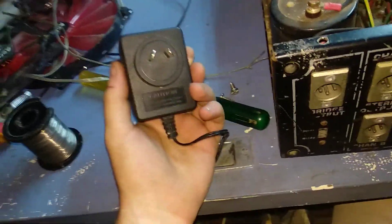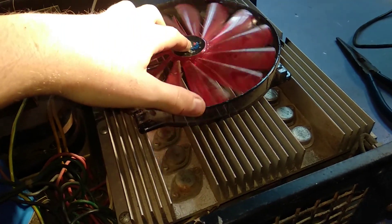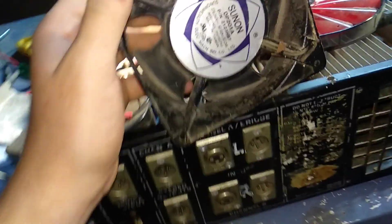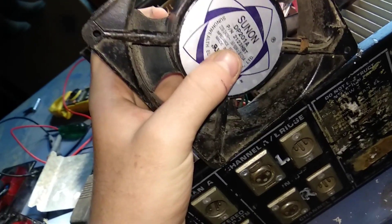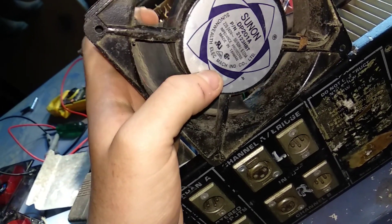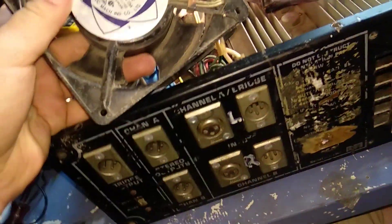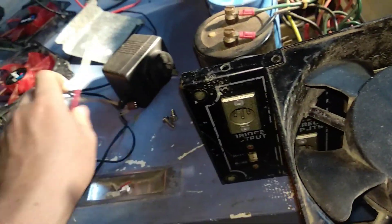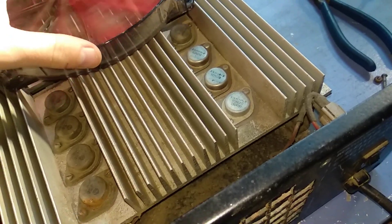So I'm going to be cutting this open. Now this fan's out of the way you can start to get a better idea of what's going on in here. This fan right here is going to be going right on top probably in a push configuration. What kind of power does it take? 0.125 amps — an eighth of 240 is 30 — so apparently this is a 30 watt fan. Jesus. Something I might take advantage of is this already has 240 volt wires that go to it, so I'm just going to desolder them and use them for the new power supply. But yeah, it's funny this amp still works — it's had many components replaced though, you can see the mismatched components in it.